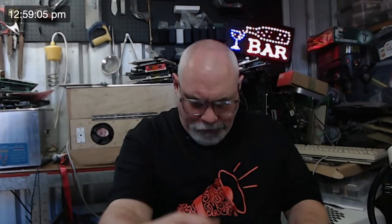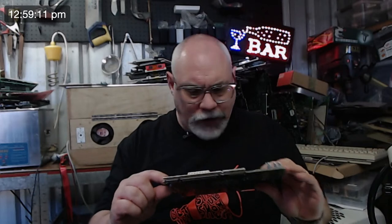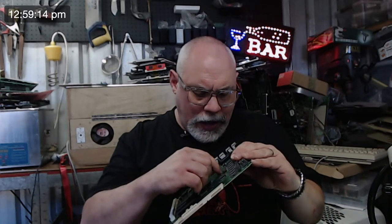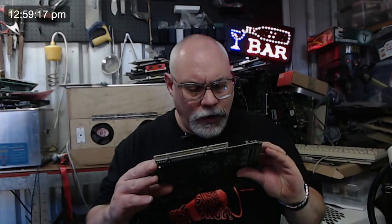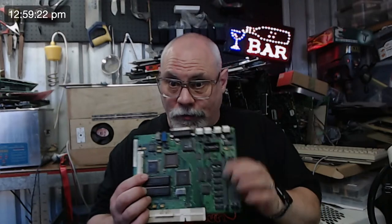All right. So let's see if we can get some work done here. The first thing I thought I might do, just before we get onto the SE30, and this is just for trying to get things finished more than anything. This is the LC575 I was working on the other day, and this is one getting a sad Mac chime. And got some nice gunk on it there. I am planning to replace these RAM chips with other ones, and I'm going to start replacing them two at a time now, and then we'll just see if we can get this to chime, and then we can at least consider this one another one done.